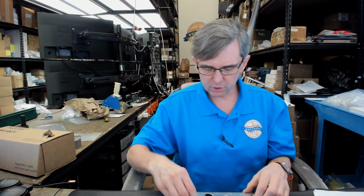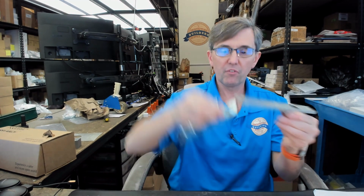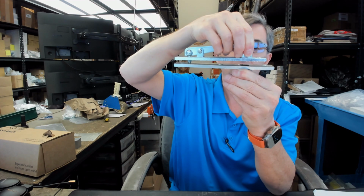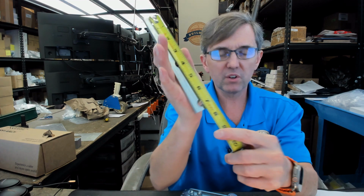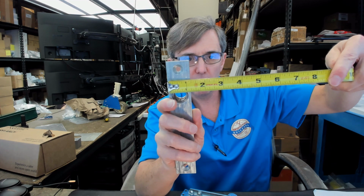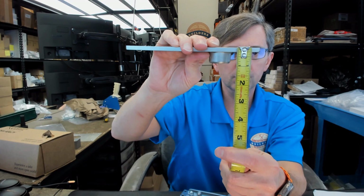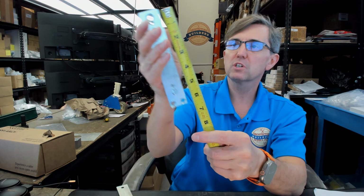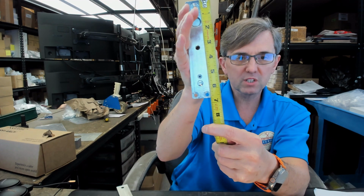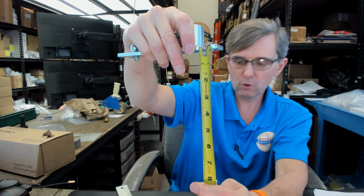So obviously before you do all that, you'll have the door portion mounted to the door itself, and you get the concept of how that's going to work. So let's take some basic dimensional properties of this. The door portion, about 7 1/4 overall width, about 1 1/4 or so. Thickness, it's probably 1/4 inch. Yeah, maybe 5/16. The header portion is going to be close, if not the same. 6 3/4, 1 1/4, about 1/4 inch.